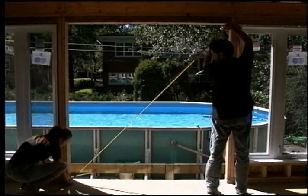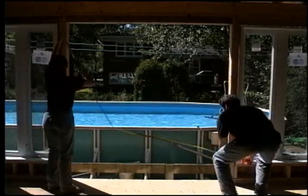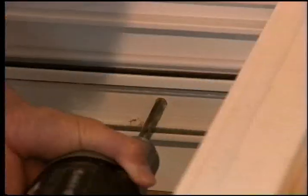To install a patio door, measure the width, height and diagonals of the opening as you would for a window. If you must widen the opening of the exterior wall, refer to the information pertaining to wall structures provided for the greenhouse window and seek the advice of an engineer.